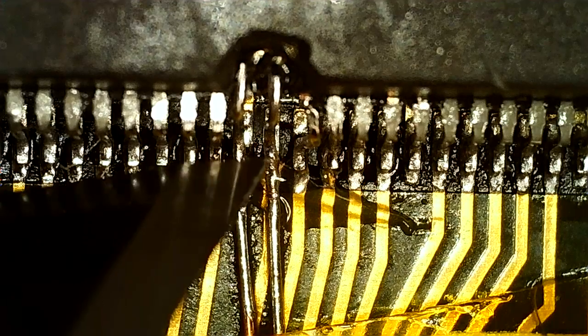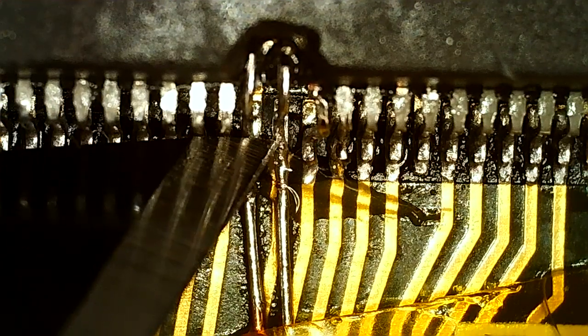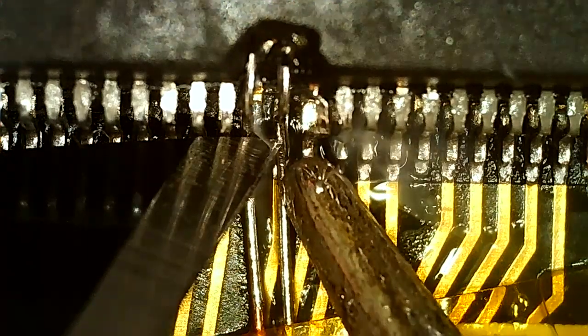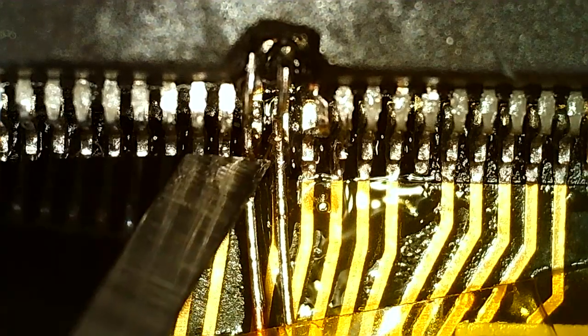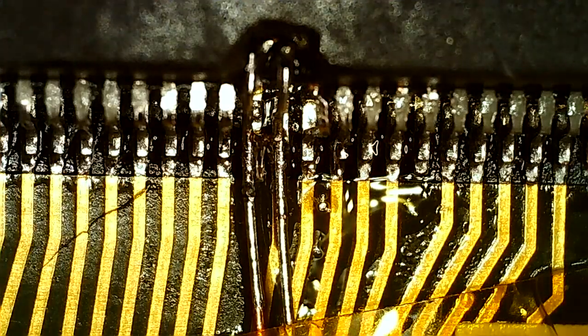And it's gonna be a little bit tricky now when we have traces there, so we don't get damage. Because I find that it's hard, you can't just bend the wire off, it's gonna rip off the pad, the solder is too soft. So we're gonna have to try to cut them. Well, that seems loose, doesn't it? Did we get it this time? I think we did, so we're ready to cut now.